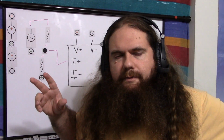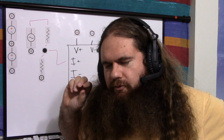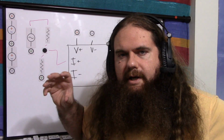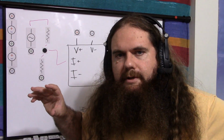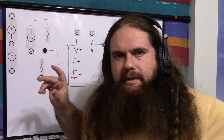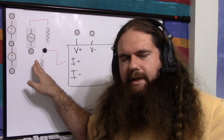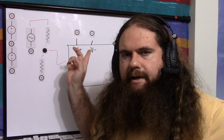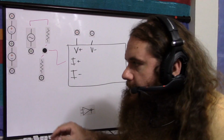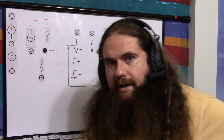Also, for various reasons, it is incredibly effective at including error in your circuit. It causes a lot of error. If you ignore it, you're just not going to have any success at all. You have to impedance match because you're bringing this signal down into the millivolt range. And now you're working with microamps. That's only an order of magnitude difference, so it's affecting it a lot. So you're going to have to impedance match, but that's easy.